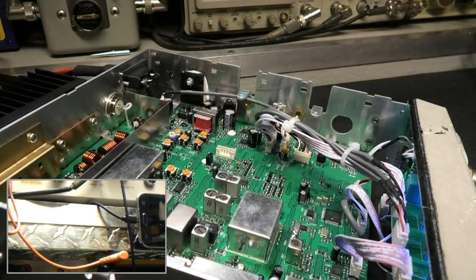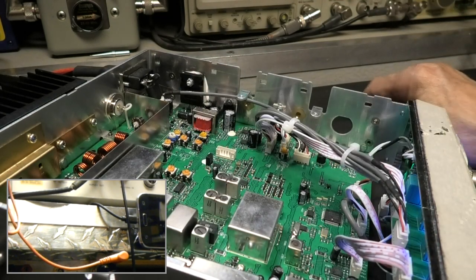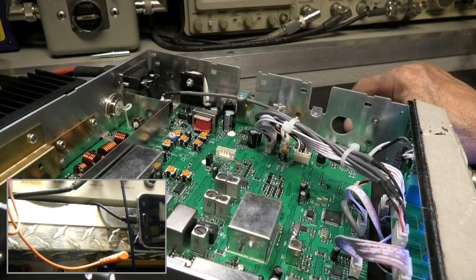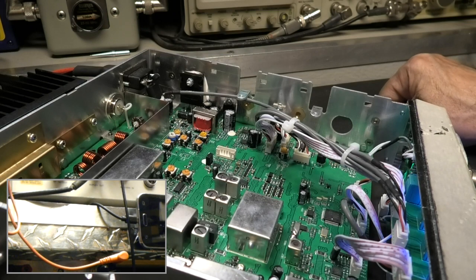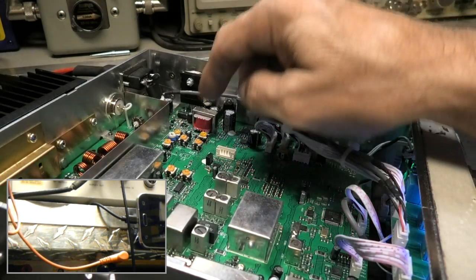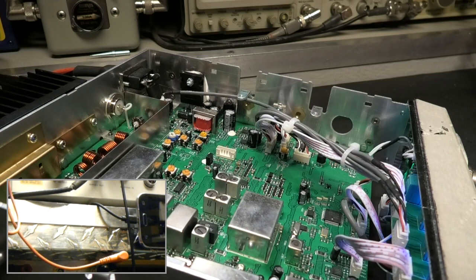See how we're coming back? The receive on this is phenomenal. I love the receive. There's more done than just, see, a lot of people think you just pop this lid, connect a cable, and jack a signal into it. That might be kind of half-assed okay if someone's jacked with it before for a regular, typical screwdriver service manual tune. But there's much more to the sensitivity and aligning each individual coil independently by itself. And the AGC, the attack time, there's more to this. More to it than I just even explained.